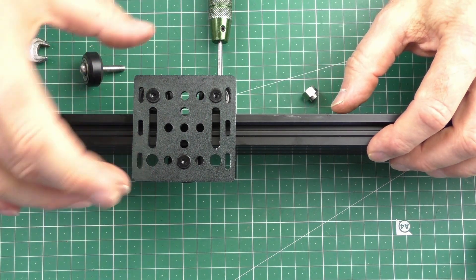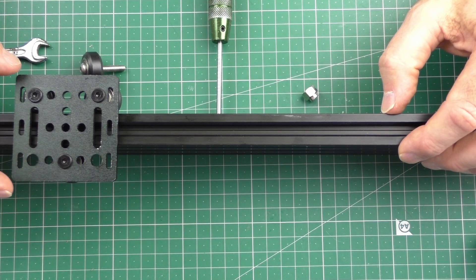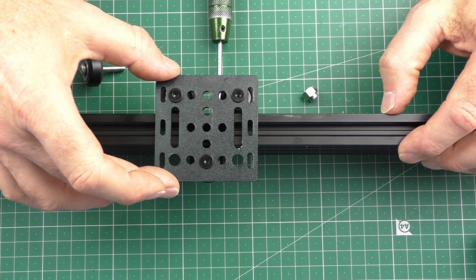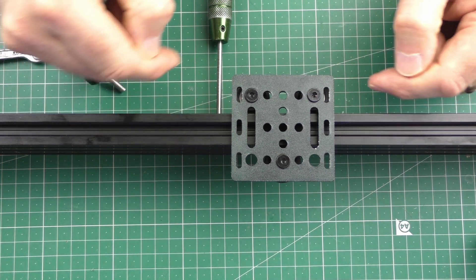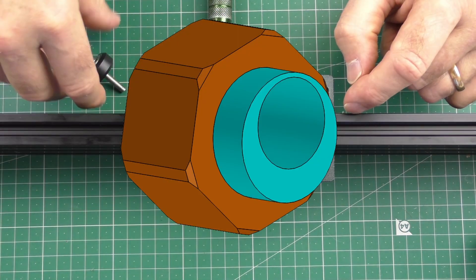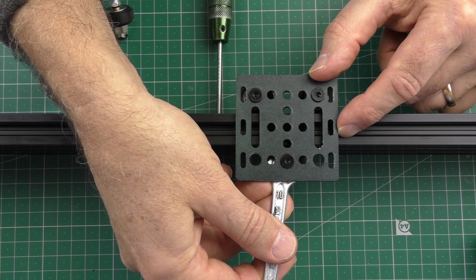Every time I start 3D printing I move all my carriages about 100 millimeters one way, 100 millimeters back. Around the 50mm mark you shouldn't feel clonk clonk clonk — that's the flat spots generated overnight rotating round. If you do suffer from that, you need to release the pressure on your adjusting nut. Again, it's just a little tweak — not even one degree at a time.